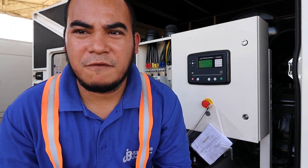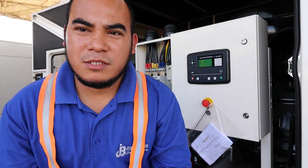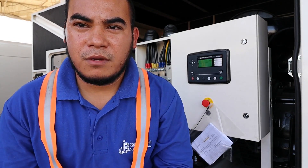The voltage is now 415V, because the voltage standard the customer is using is 415V. You can see the generator now shows 'generator available,' meaning it is now normal. Let's proceed with the other tests for the rest of our troubleshooting. We are going to test if the breaker is closing or not, and what error appears if there are wrong connections. I will start the generator.